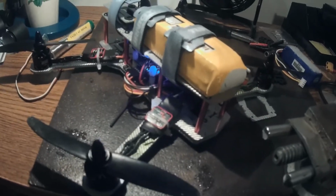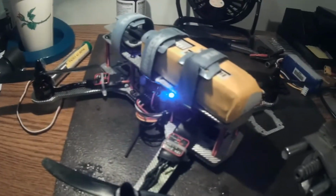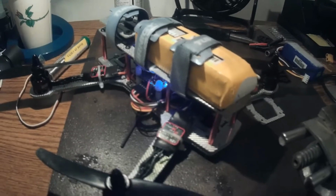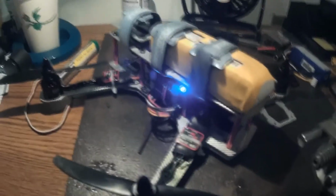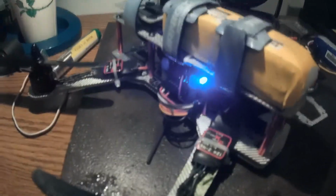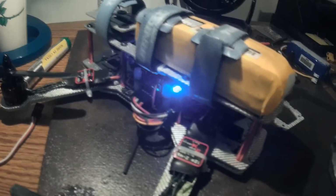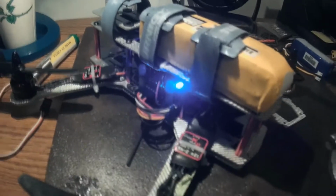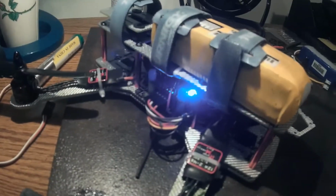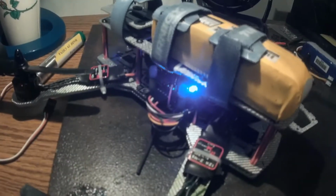I thought I had a problem with the flight controller when I tested it. In the Cleanflight configurator, I could spool all motors up evenly, but when I spooled them up with my radio and watched through the configurator, the 1 and 4 motors would spin up faster than the other two, and that was creating some yaw. But after I changed to a better battery that could support the current, that problem just went away. I think it might have been the ESCs not getting enough amperage to distribute evenly. But anyway, I got that issue taken care of.